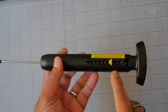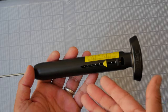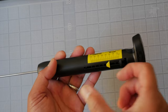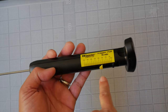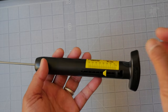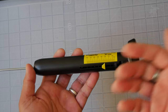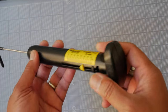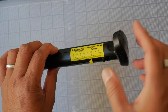This is essentially a bathroom scale sideways and miniaturized, because traditional bathroom scales work with internal springs that provide resistance with a known quantity, and that measures your weight. This is the same case here, measuring three pounds of resistance on that trigger. You could effectively take a string around your trigger and put a three pound weight on it and that would break your trigger, as opposed to a one pound weight that wouldn't. That's how you determine trigger pull weight. So let's see how accurate this is.